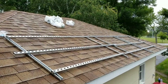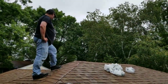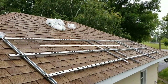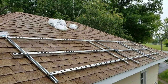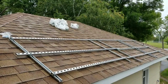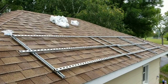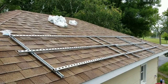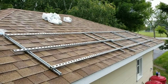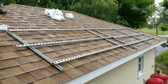Alright folks, this is the layout. We have to be off the roof — rain is coming. But this is the lineup we're gonna be doing here. We're gonna be mounting the panels on this. This is 194, approximately 15 foot. So the panel is gonna go horizontal. These are the 300-watt modules — three panels at 900 watts total.